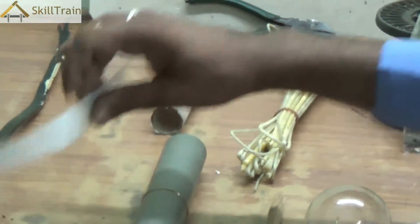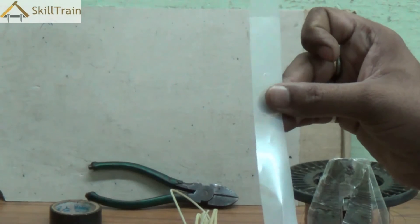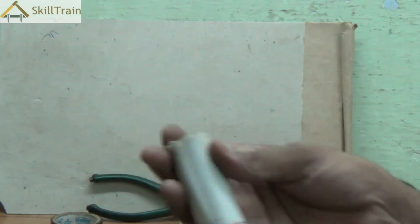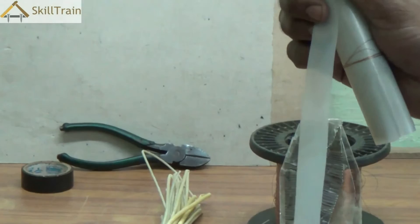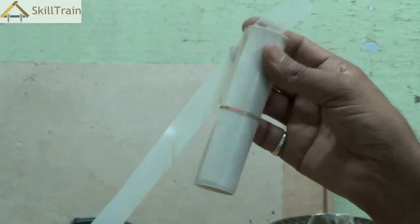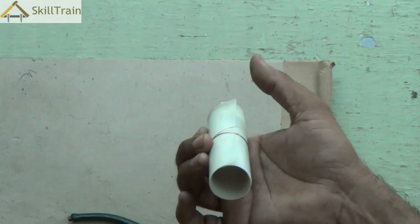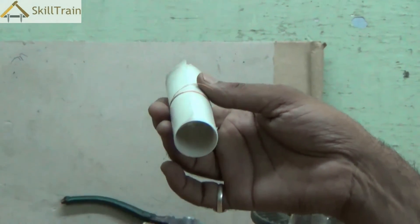One more similar paper is called PVC paper, made of PVC or polyvinyl chloride. This is also a good insulator and is wound around the wires while doing motor winding. It comes in different thicknesses, and you can pick the respective thickness depending on where you need insulation. This is used in motor winding to ensure that the coil does not come in contact with the body of the motor, thereby avoiding any short circuit of the entire winding.